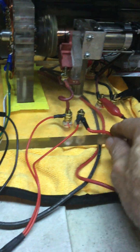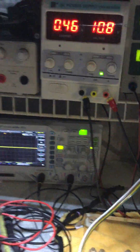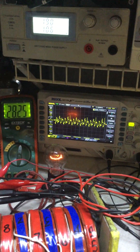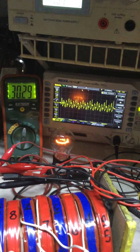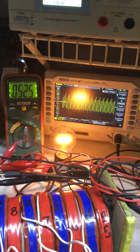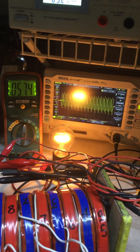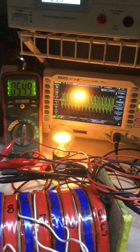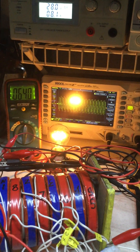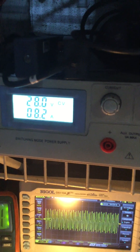I'm gonna turn this — I told you to always use this switch that connects the positive through your brush from the power supply. You put this little switch, it's very handy and you need it. Okay, let's see what happens. The motor is running, very low — increasing it. It's pretty bright, and our amperage has increased: 7.8 amps at 28 volts.